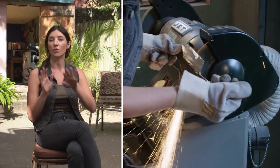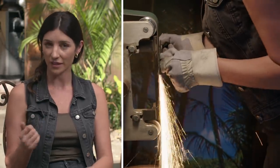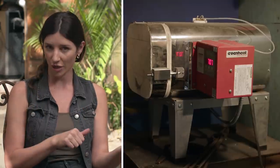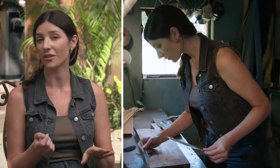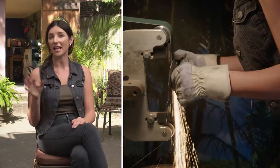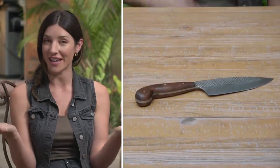So: second stage at the grinding stone, removing excess material. Third step will be at the sanding belt — bringing that knife down to a finer shape — and then heat treating, finding a handle from raw materials, attaching the handle, gluing, pinning, letting that cure, and then a process of sanding, sharpening, and finishing. I think we've covered a lot today. Obviously we could continue on with other levels of complexity, but we're gonna stop at this level. We've outlined the fundamental steps of creating a functional, characteristic knife. Thanks, Wired.